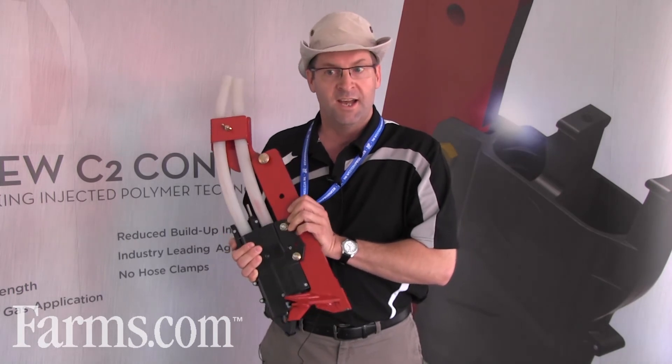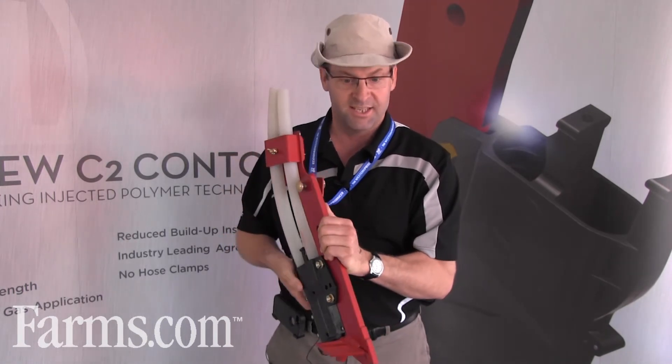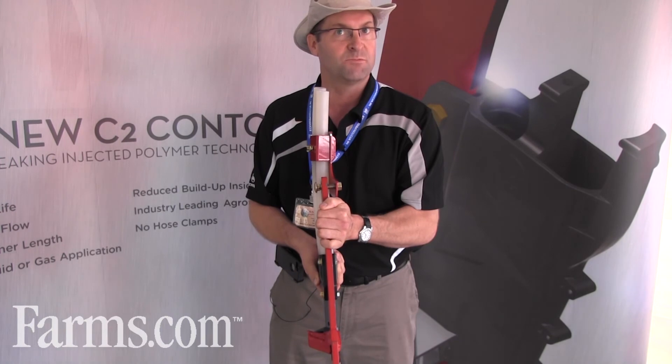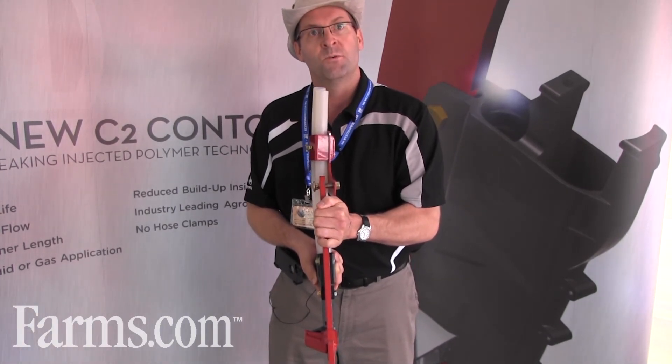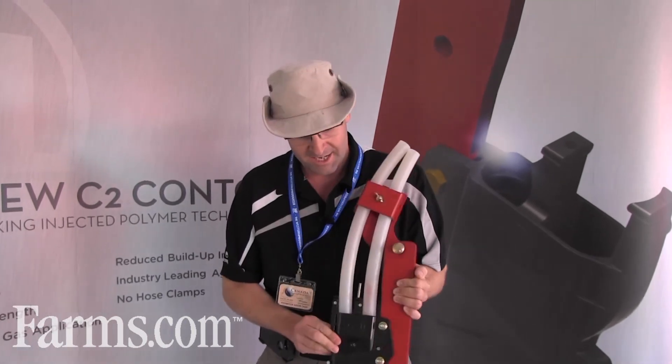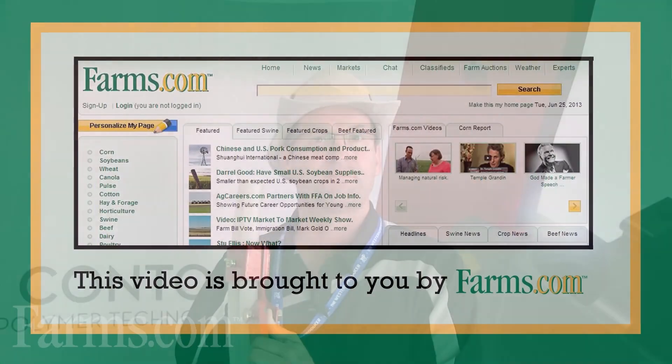Probably the last benefit I'd highlight is that the profile of this new material is quite a bit narrower than our cast material. The total width running through the soil is about an inch and an eighth, compared to the cast material at about an inch and a half. A narrower opener with less surface area for soil to stick to should help reduce soil disturbance, improve field finish, and reduce problems with soil being spread onto adjacent furrows — all told, quite a few nice perks and benefits tied into this new design.